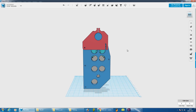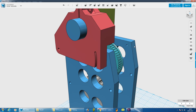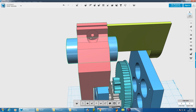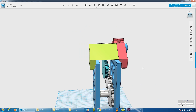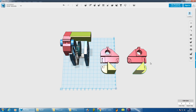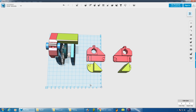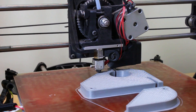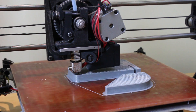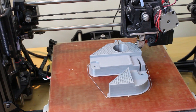As before, we're going to make a motor mount on a pivot using 6mm studding, with a groove for a 4mm bolt to tension the motor and belt against the pulley. The motor can also move sideways and will be clamped in with a bolt through the top — pretty much the same as last time but a bit wider to fit where it's going to be attached. I'm printing these in symmetrical parts so the motors face outwards on each leg. I'm printing one pair on this printer and the opposite pair on another. These parts are pretty tall, all ABS, and looking good so far.